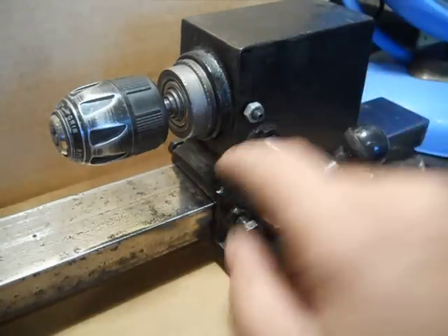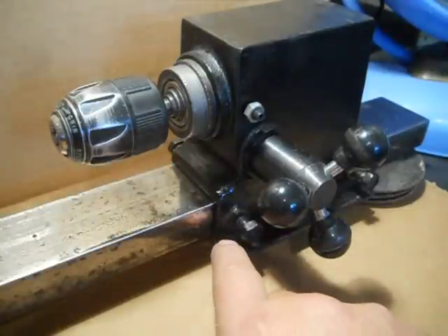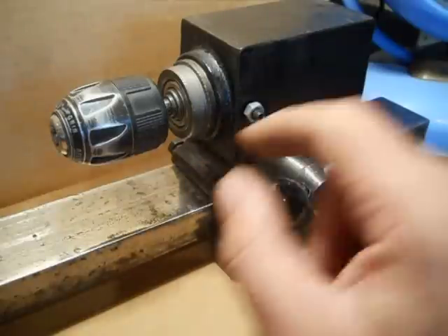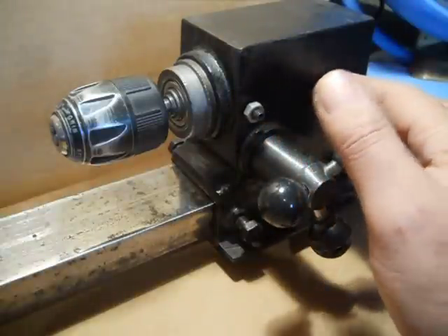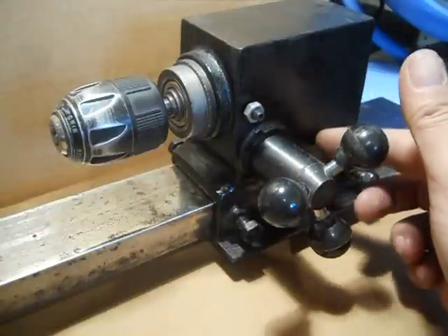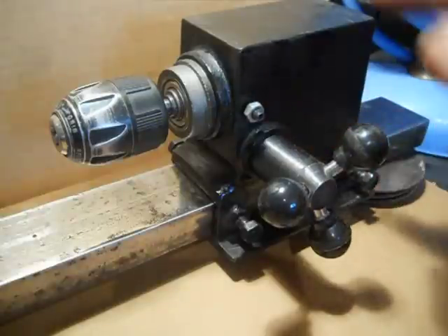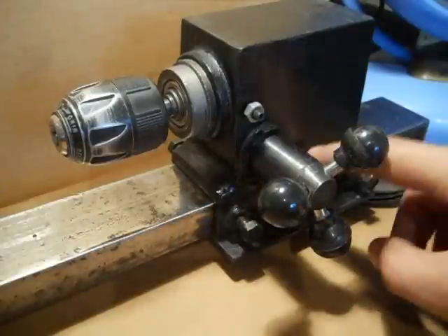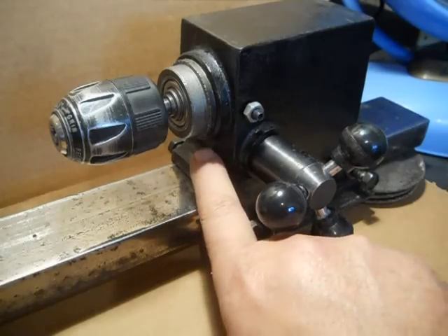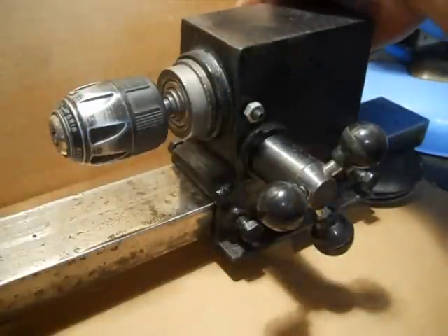This was kind of hard to weld — all this metal, because this is one type of metal, kind of like a spring steel. This is like a quarter-inch mild steel, and this is a cast steel — more to me of a cast steel than a cast iron. I did develop a few cracks in here, so I went back and reheated the whole thing and brazed it. Because this part was paper thin — the way this was molded, the other side was real thick, but it was real thin along here. In the back it's welded, so it's welded the front, the back, and then on the back side over here.